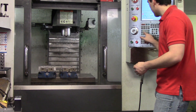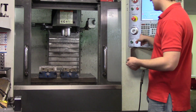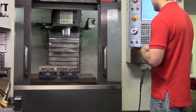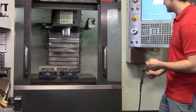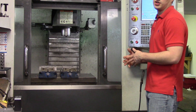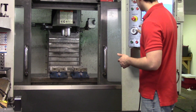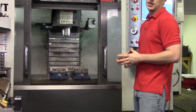You do have the option of holding the button down and jogging in a specific direction, but you're not going to need that until you understand the coordinate system of the machine — which way is positive, which way is negative. Jogging mode is also very dangerous. A lot of people, including myself, have been jogging in one axis and accidentally hit the Z button, and it starts jogging down into your vise — that can be with a fly cutter or a shell mill, it's very dangerous. Over time you'll get used to it, and then you can use the handle jog mode confidently.